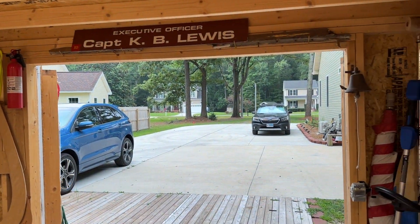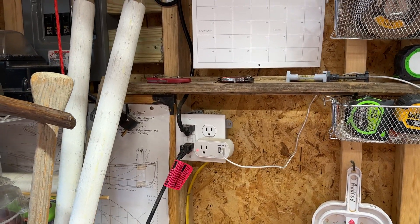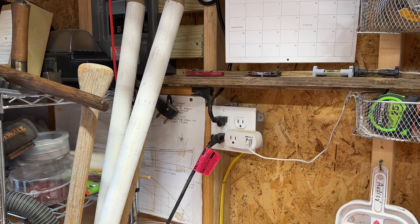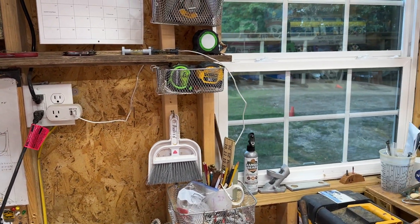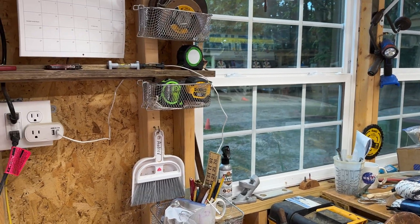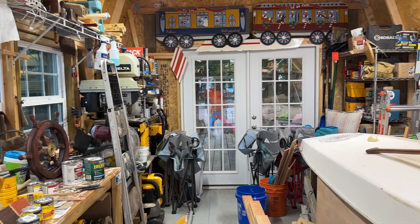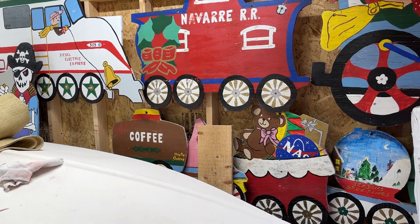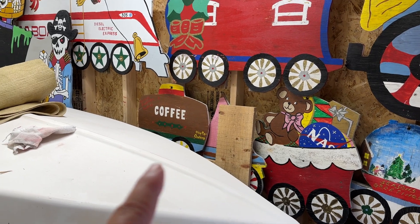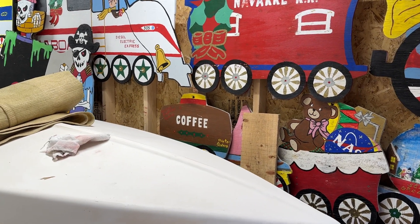One other tip: we pinned up a little quad outlet over here so we can plug different things in. We've got chargers plugged into a utility strip, and our shop vac stays powered up. There's a little USB port that doesn't get used too much. On the other side we also did quad outlets, but we had them put down by the floor at about 16 inches like you'd find inside a house. Turns out we should have had them put up higher — I can't even see those plugs right now because they're buried. If we'd put them up higher, we'd have been able to use them.